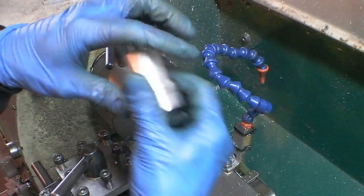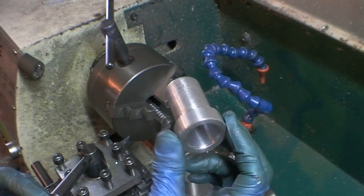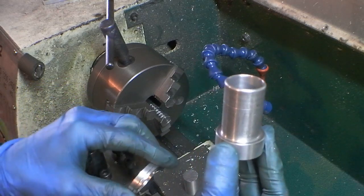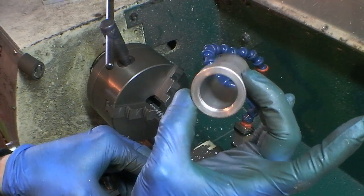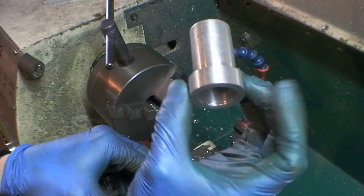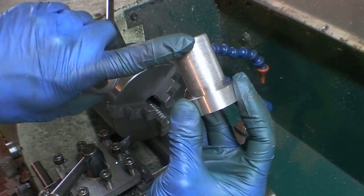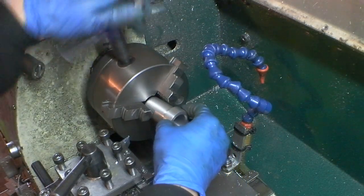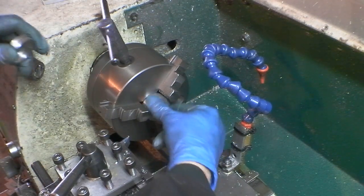The other one I wanted to show off is this guy. I made this as one of my first things on my lathe, and then I went in later and touched it up on the CNC to get little round corners and stuff. Very simple — it started out as 1.5 inch aluminum tube with a 1 inch hole. I machined this side so that it just fits into the chuck, into the inner recess of that chuck there.